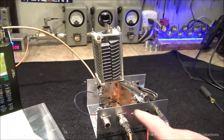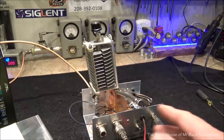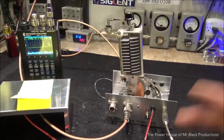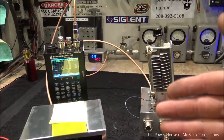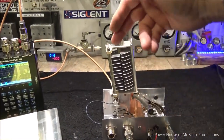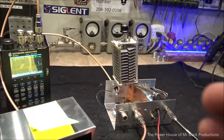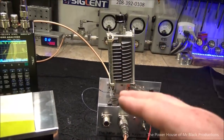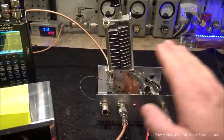If we don't tune this down to where it's at a 1.0 or a 1.01 or 1.03 or 1.05, then the coax, the capacitance in the coax becomes very active. So if he's not using a 3-foot jumper, and let's say he's using like a 5-foot jumper, he's going to have a huge SWR impedance bump as the RF tries to come through, and it's going to limit his ability to hear. We'll see the reverse when this thing goes into transmit mode. We're going to see that impedance bump, and it's going to represent itself as a high input SWR to this device. We don't want that.